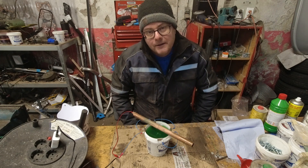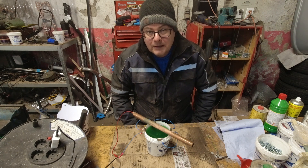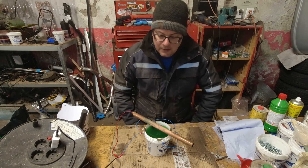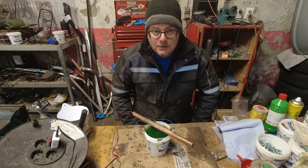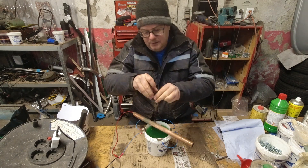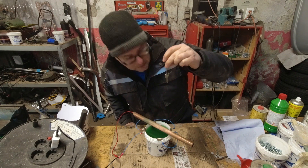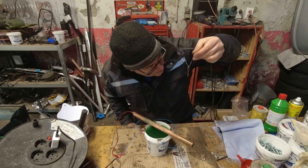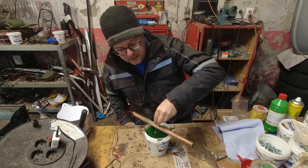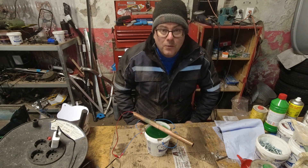To get a good solid plate on things, I've found it takes about 20 minutes of this process. If you're looking for just a light coat, you can do it in a very short time. Let's pull this out. Already I can see that almost the entire key is coated, but it's going to take longer to get a buildup that's enough to actually protect the key. So we'll let that go for a while and come back.